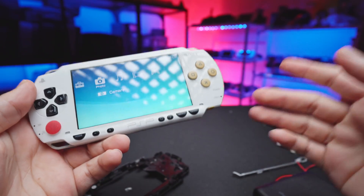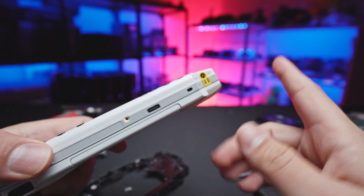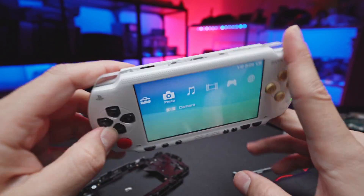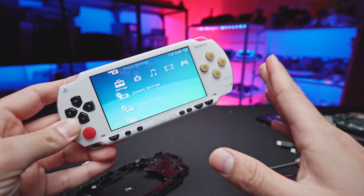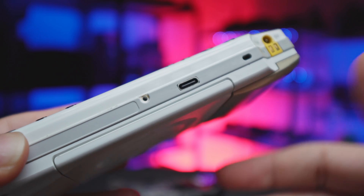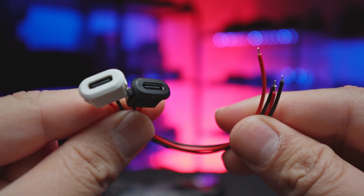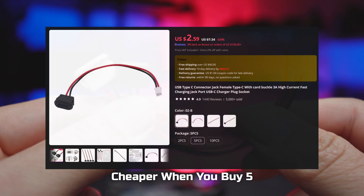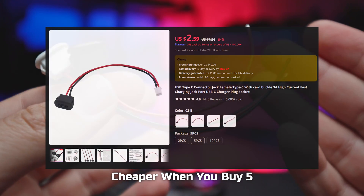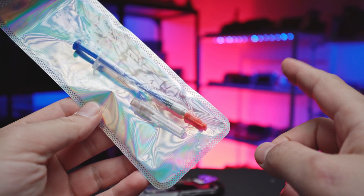Three days, almost gave up each day, but eventually got something that looks nice, is easy to follow, doesn't use any solder, and most importantly looks very clean. This charging port is not for data — if you want data you'll need to do some soldering, but that will be for a different video. You're probably wondering how to do this solderless, and the answer is pre-soldered Type-C ports that you can get for a dollar a pop on AliExpress.